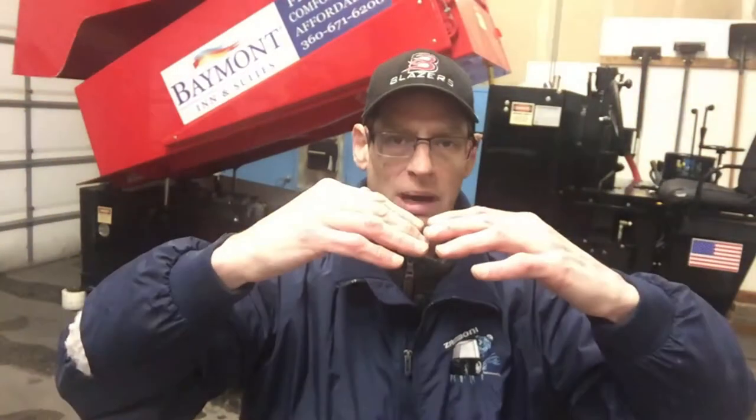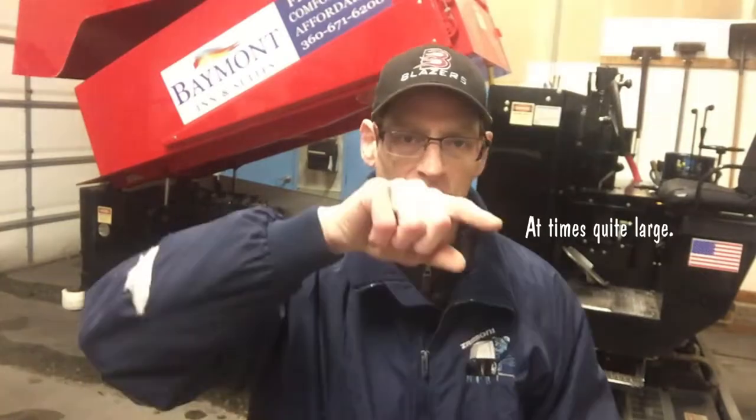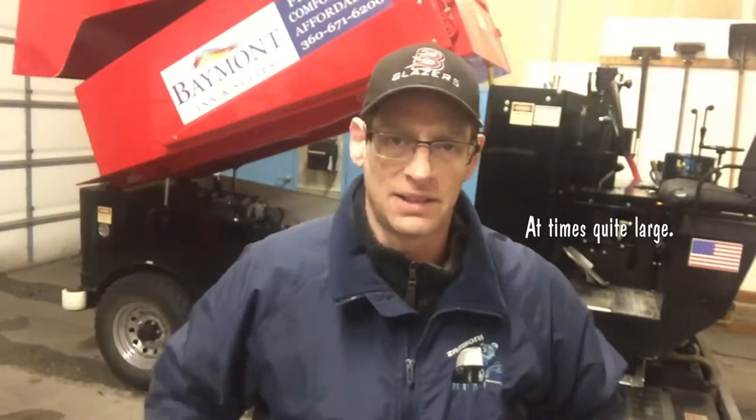We had times when our old dehumidification system wasn't working. We used to have three mechanical dehumidifiers that really weren't doing a good job. When it went down on a rainy day, the air inside of the building would condense on the top of the ceiling and would kind of work its way down to the bottom of the insulation and drip down in these long rows. You'd have all these little bumps in the ice. And if you've worked at an ice rink and the dehumidifier went down, you probably know what I'm talking about.